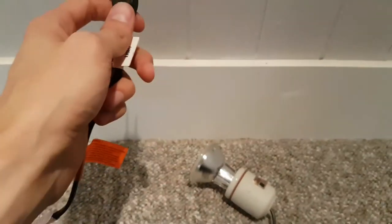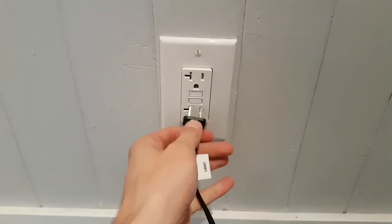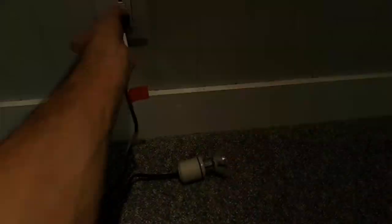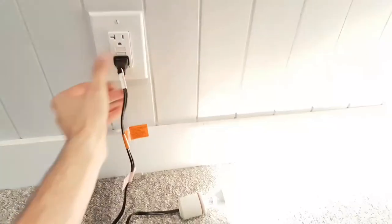And I have with me just a halogen bulb and a socket to make sure that it works. Perfect. And now if I hit the test button, kills power, and reset brings it back on. Perfect. Mission accomplished. A safer basement and aquarium I shall have.